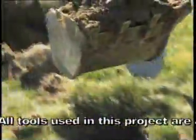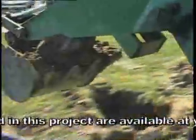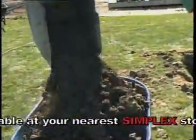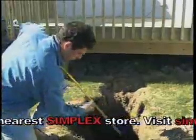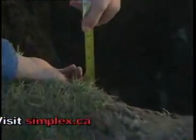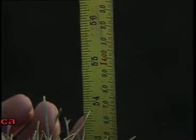Digging out the holes to pour in the concrete for the foundations of the patio is surely the most difficult part of the project. Using light machinery, such as a small tractor, will make excavation work much quicker and easier. The holes should be deeper than the frost level to prevent the posts from lifting. In most cases, this equals approximately 54 inches.